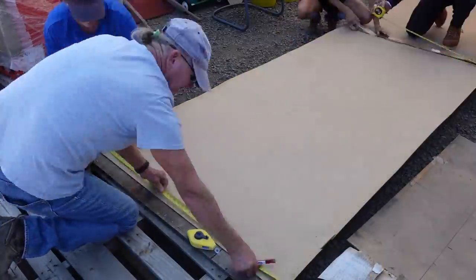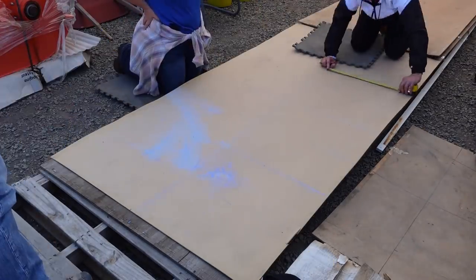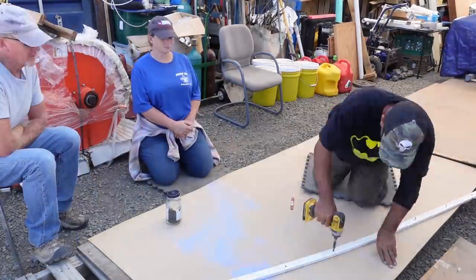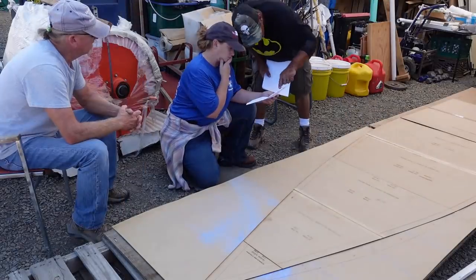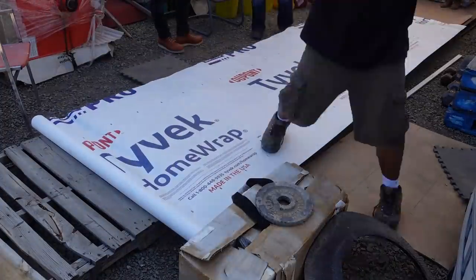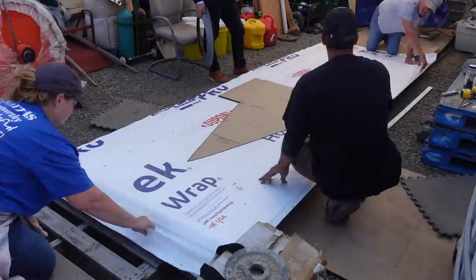What's up everybody, this is Eric Reid Harry, and in this video I'm going to be showing how we built the double shell dome. The reason I built the double shell dome is because it's a much faster process of building an aircrete dome than making bricks. If you're making a dome using the brick method, you have to have forms to pour aircrete into to make bricks, and you're only going to be able to make so many bricks in a day depending on how many forms you have. The great thing about this system is there are no bricks.